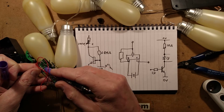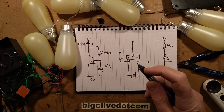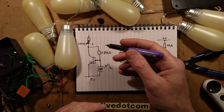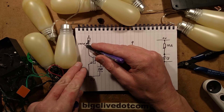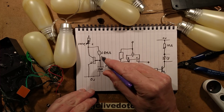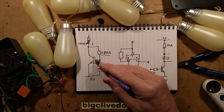There are two external resistors on this side going into the chip. It could be that one of those resistors is the pull-up, or it could be built into the chip itself as a weak pull-up. But it can get pulled down to emulate pressing the button by this transistor, which is biased on very gently by a very high value resistor.